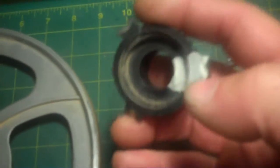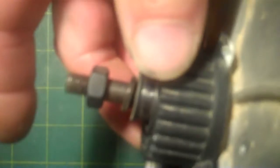That's going to be interesting to see how I'm going to do that. I have to go in. Okay, I see how it's going to be done. Alright, that's what I got to do then. I got to work on the back side of this now. Take this out, chuck it here, take all this knob off here, and then start doing the backside internal boring. And the reason why this internal boring on the back side is needed is because on the wheel itself there is a part of the wheel right here that has to fit over. It actually registers on there like that. And because of that, I have to machine that to fit.